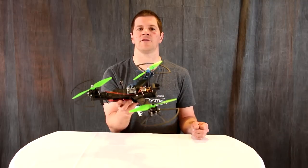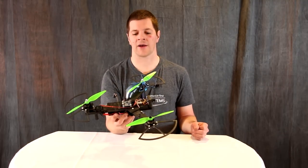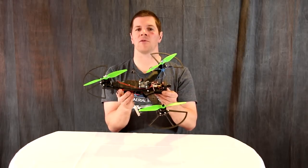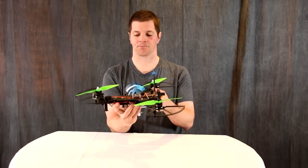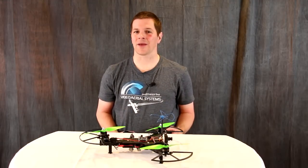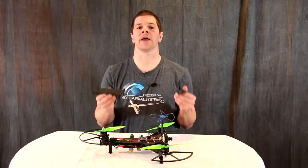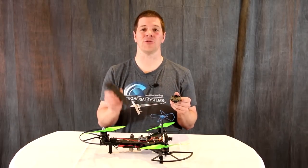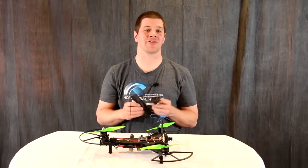The Cerberus can take a 1500 to 3000 mAh 3-cell battery pack strapped to the bottom of the frame. It is also plenty capable of holding a full FPV video system. While I'm sure you'll find the Tricopter incredibly durable, it's only a matter of time when racing before you wreck and break something. For that, I include a complete crash kit with the aircraft — that includes extra arms, extra swivel assembly, and even extra landing gear.